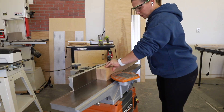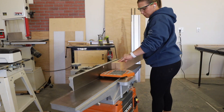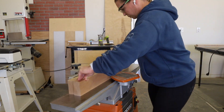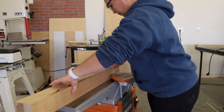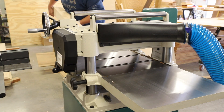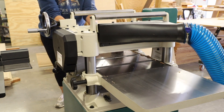When the glue was dry, I released the clamps and ran all of the pieces through the jointer to flatten them up on one side. Once the pieces were finished on the jointer, I set up my planer and ran the other side through to make sure they were all at even thickness, then planed them down to three and a half inches.